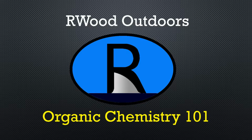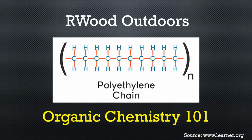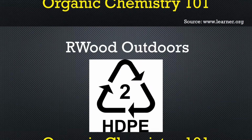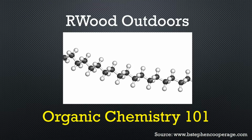Before we get started with this repair, I want to give you a quick RWood Outdoors organic chemistry lesson. So most modern kayaks are made out of a material called polyethylene. And polyethylene is a thermoplastic material, which in essence means that I can melt it over and over and over again and still get really good mechanical properties every time. That's in contrast to a material like an epoxy, which is a thermoset, and once that is cured for the first time, it's basically done. So a repair on an epoxy would be done by adding a filler adhesive that actually glues the two materials together. But in this case, with a plastic polyethylene, I'm going to do a weld repair where I'm taking new polyethylene plastic and welding it back to the original material by melting them together. Let's see how that works.